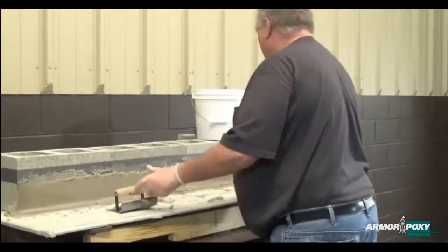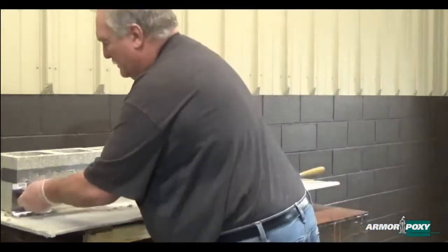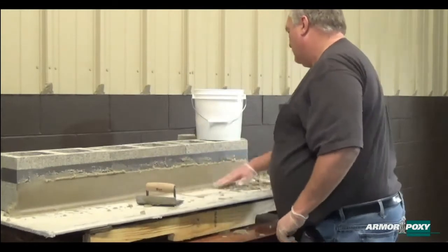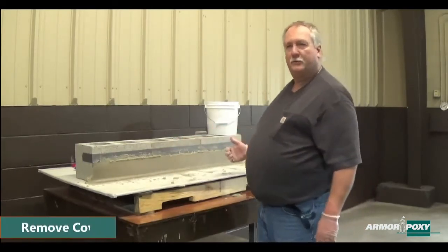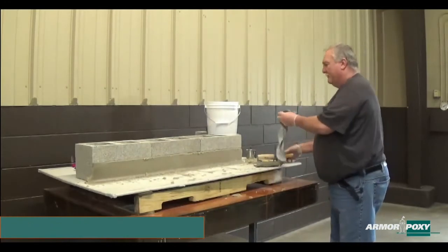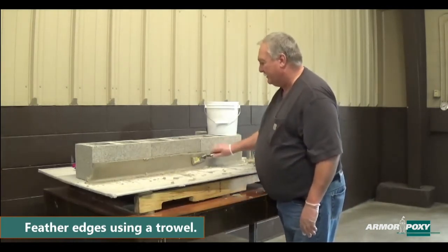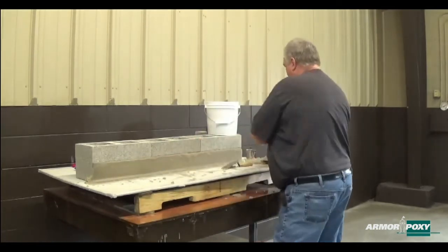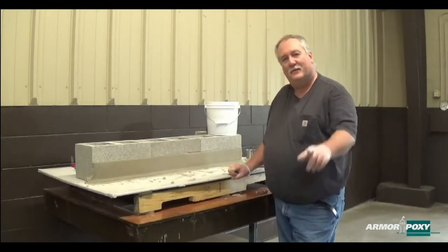Apply your pressure to tip the top of your trowel and just smooth it up. By applying some pressure you can always pull your excess down. And it's as easy as that. Usually if you have the cove strip up on the top you can let it dry and then just pull your cove strip up when you're done, or just pull your tape and feather it out a little bit if need be, or wait and knock it down later. And there you go — your cove is done. Easy as that. Thank you for watching.